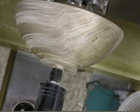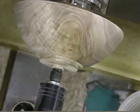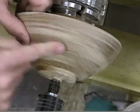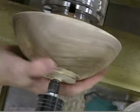Okay, all right. So going down that same path, I guess I don't really need this, but I'm not going to turn the foot off yet. Right now I would have had the tool marks still in here. Maybe for grins, I won't even bother sanding this other half. If you don't sand with that 80 grit and get rid of all the tool marks, you cannot get rid of them later. That's the key, right? So I'm going to leave them on here.